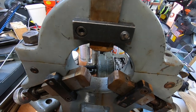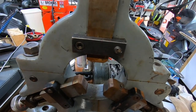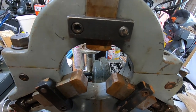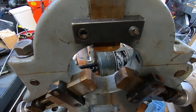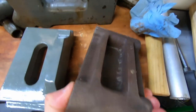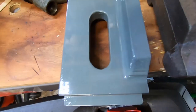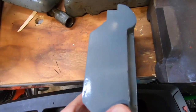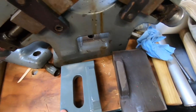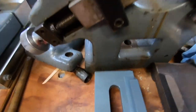They cast it in sand — they didn't make a pattern, but cast it in sand. With shrinkage it's probably not far off 90% of the size. They made me two castings for not very much money. Here's one of them. I thought that was really nice. I then machined a hole in it, painted it, and that's a nut for it. I've also made some threaded rod the right size. So that's something else done.